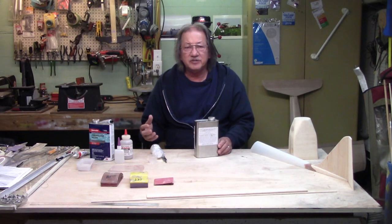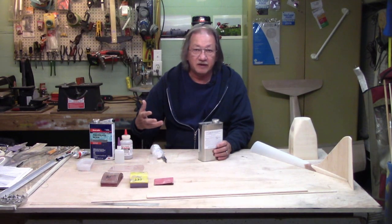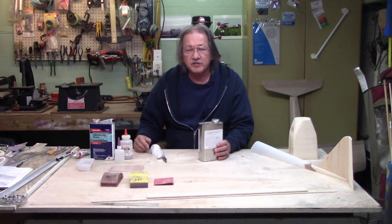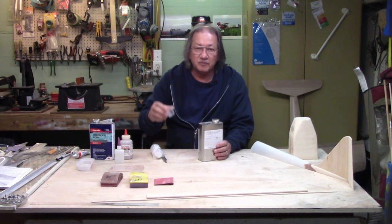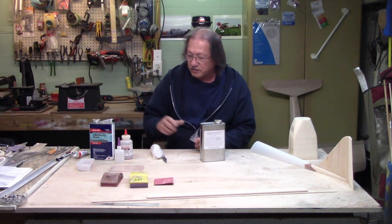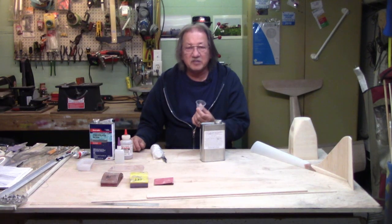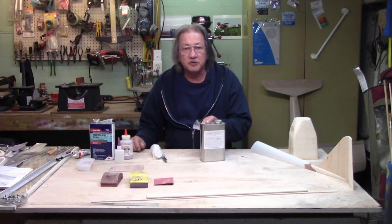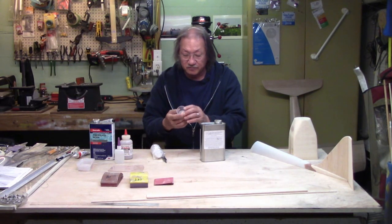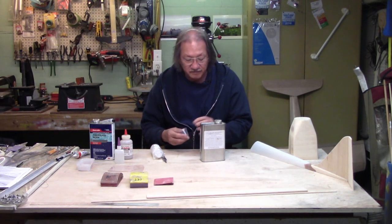From when I talked to other guys that use the Bondo brand, who switched also, and that's where I actually got it from, I was told to just go to a 20 to 1 ratio. So if you count in ounces, it'd be 1 ounce of the styrene to 20 of the resin. And when I mix it up, I don't mix up a lot. I usually mix up when I'm doing something small, about 25 cc, and maybe I'll put a couple of drips of the styrene in there, sometimes more.